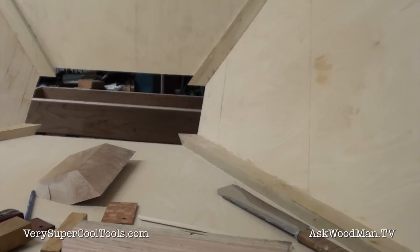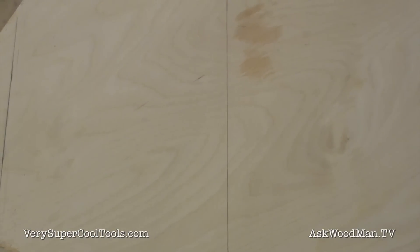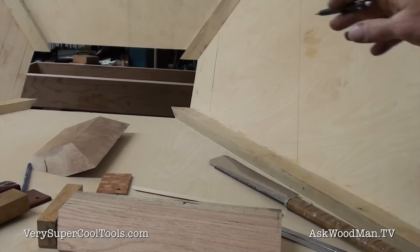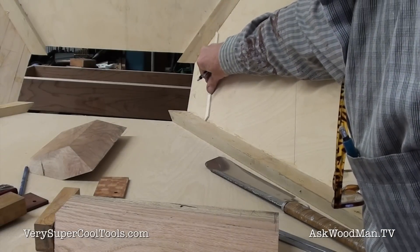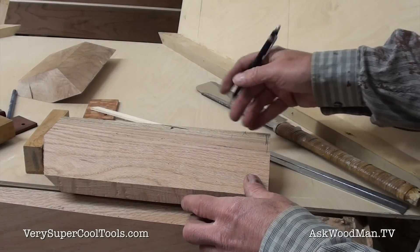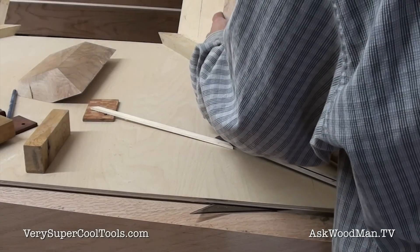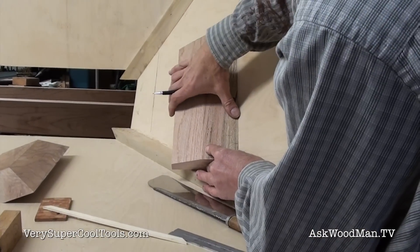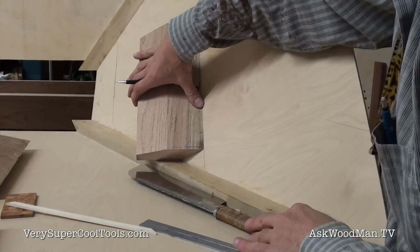We determined where our bottom mark is for the next piece we need to cut. This line here is our reference line, since we can't get our piece all the way down between those cleats. Since it's also hard to measure in that area, I just cut a little story stick exactly point to point along that line, and we're transferring this mark onto our piece so we know where the end spot is. Tony will hold this exactly on our parallel line, and I'm going to stack blocks up until the pencil is exactly on these lines and I'll scribe around the three different planes.